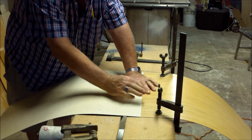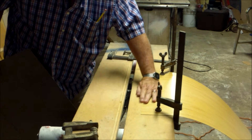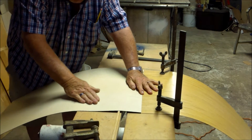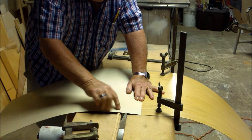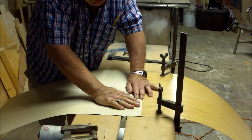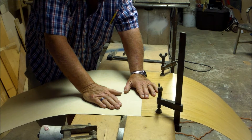Now, if you were gluing these two pieces together, what you do is glue one down first. Spray contact cement on both sheets and on the piece you're setting it down on. Put this one down permanently. Then I'd have sticks under this side so it wouldn't stick as I lay it down. I would lay this down here, match up everything perfectly. Pull out all my sticks and press this down, but leave that one stick there. Once this is down solid, because there's a bow in this, I pull that stick out, then press it down. That little bow, when you do it that way, will give you a force up against it — it'll really give you a tight fit, a perfect fit.